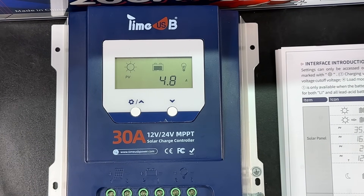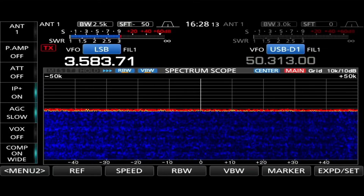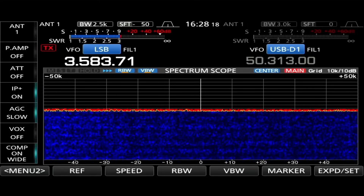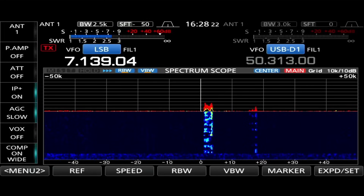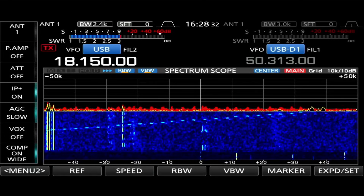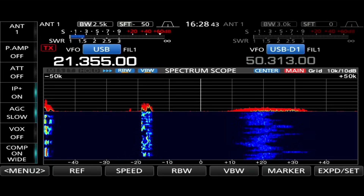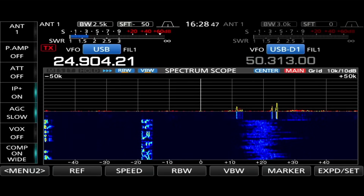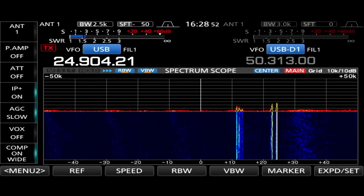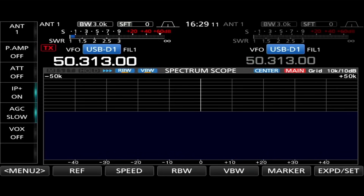The final thing: is this RF quiet and properly shielded so we can use it alongside ham radios? On 80 meters, my noise floor is normal — no RFI. On 40 meters, nothing coming through. 30 meters, no nasty hash. 20 meters, looks good. 17 meters, looks good. On 15 meters, the hash on the right-hand side is not from this charge controller — that's a new RFI problem from someone in the neighborhood. 12 meters, same thing: the hash is just local RFI, not this controller. 10 meters, again, the stuff on screen is not being caused by this — probably dirty power supplies from neighbors. And 6 meters, nothing. Totally clean on the radio.